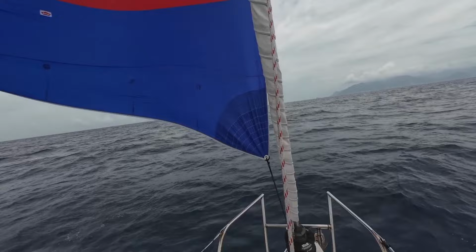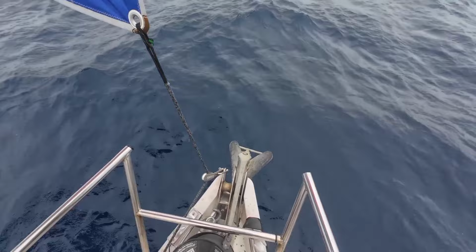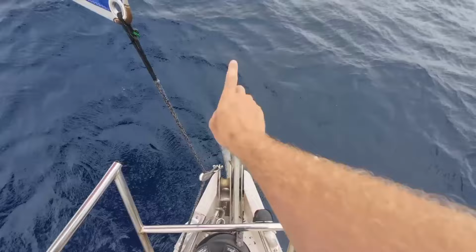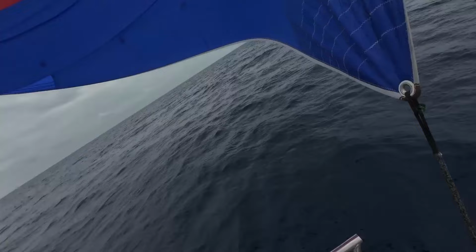Now the second part of the sail, here it's even written there, is the tack. Now the tack is a tricky attachment on this boat because usually you have a bowsprit out here, which allows the tack to get right down beyond the front of the boat. Not possible on a Nicholson 35, although some boats have had modifications to build a bowsprit. In this case, I'm repurposing the bow roller through the use of some blocks and a shackle. See that there?